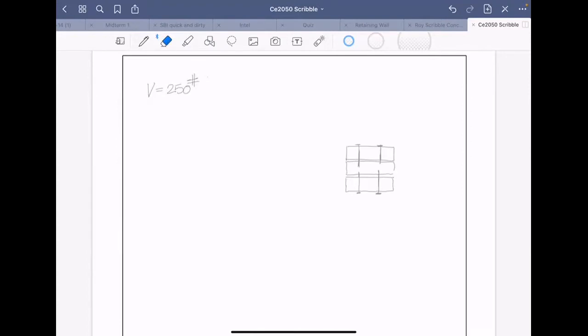So let's say, and we'll solve real questions, this is 3.5 inches. This is 1.5 inches. And this dimension kind of repeats, right? 1.5, 1.5, 3.5, and all that stuff. So we'll calculate the moment of inertia as three separate pieces and as one solid piece. And you'll see why we want to stitch it together, and then we'll start solving the problem. So I'm going to teach you why we need to be doing it, and what the value is.